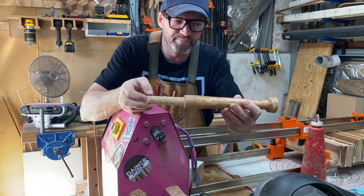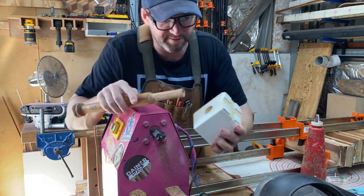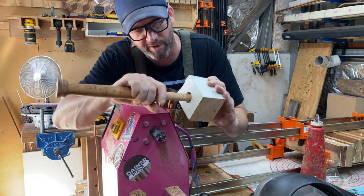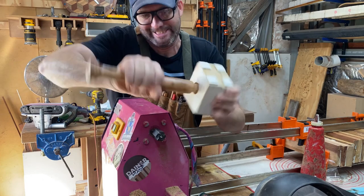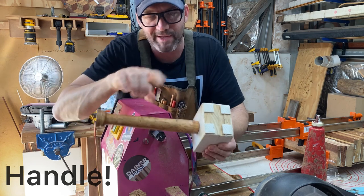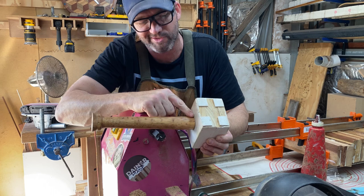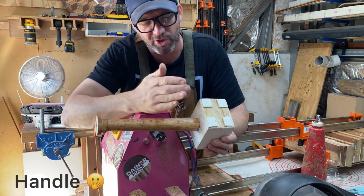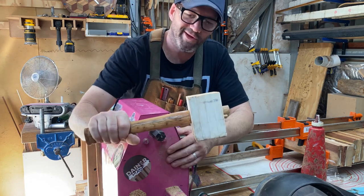This is just pallet wood. I've turned down a handle, I've turned the end down, and just doing some testing. I've got the two diameter holes here - one for the dowel to go right through, and the second one for the mallet to actually slide inside. But once the mallet's turned round, I'll have a nice neat join. I've got to make sure that's deep enough so you don't see the flat head of the mallet against the curve of the mallet head. Check it out, there's a mallet. Who wants to buy that one?